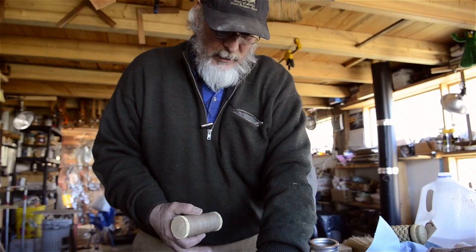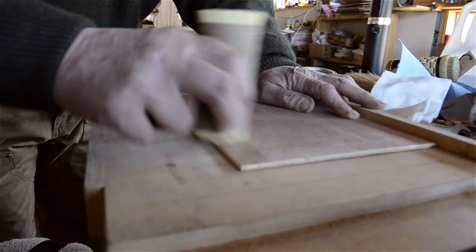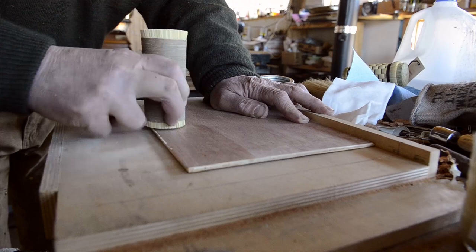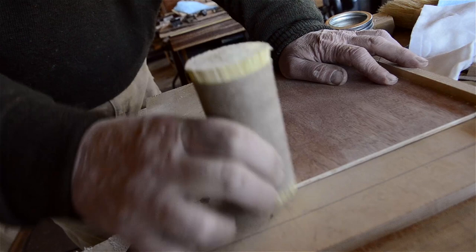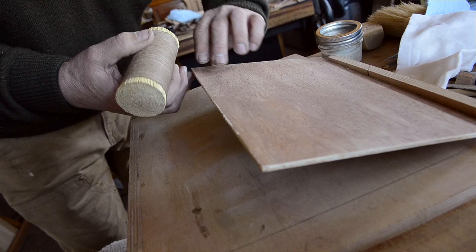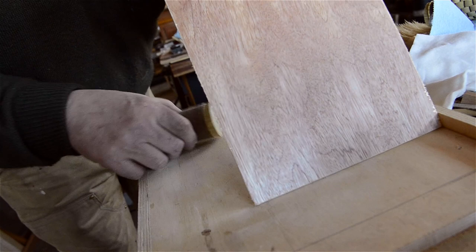I'm going to take the backside of this board, which is just a piece of plywood I've done nothing to, and rub it with this polisher. You can see it's going to begin to change the character and the gloss of that surface. It just compresses and polishes the fibers of the wood — you can probably see some change in gloss right at that corner. That's just the sort of work this tool does.